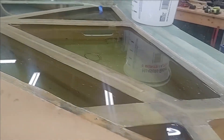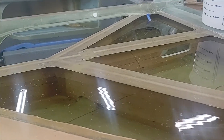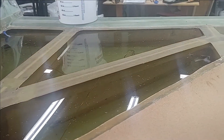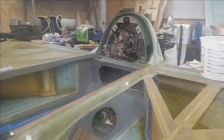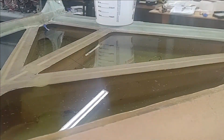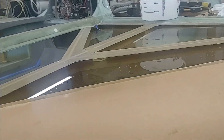I'm really happy with how it went. As you can see, I did the T-hat method on the tops of the ribs and baffles. Once I flip this bird back over, I will close it out with the top skins. One reason I'm not closing out the top skin before I flip the bird and glass the bottom strake skin is that I want easy access in here to install the window.